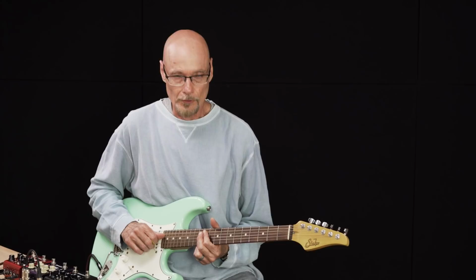To do that, we developed an architecture that contains a modified all-pass filter as the basis of the six-stage phaser. A phaser is a filtering effect that's made up of cascading all-pass filters, and six of them are in a six-stage phaser. There are no delay lines in a phaser. But with our modified all-pass structure, we're able to expand the time response of the all-pass filter seamlessly and continuously.